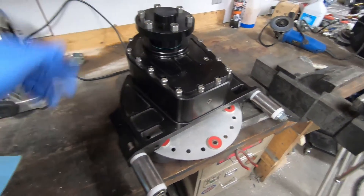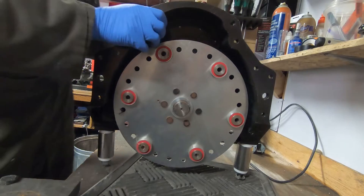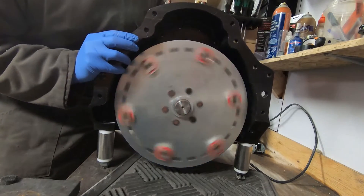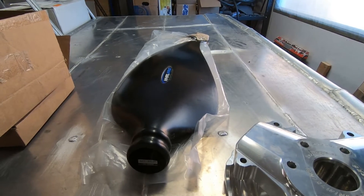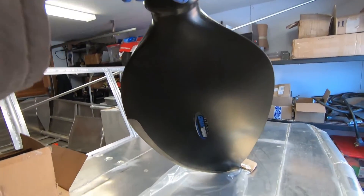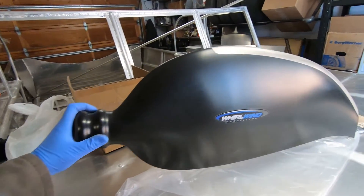The rotation is opposite of the engine rotation. I had this made with a 2.5 gear ratio that should put the LS engine into optimal RPM range. For the propeller it's a carbon fiber piece made by Whirlwind — this is the super wide 80-inch prop. I'll be using it as a three-blade setup.